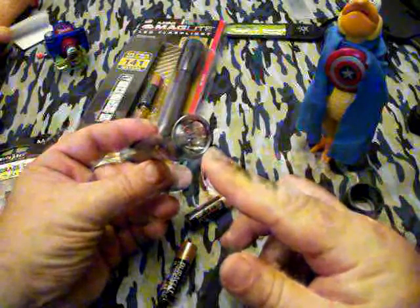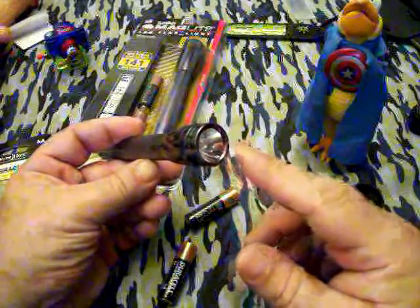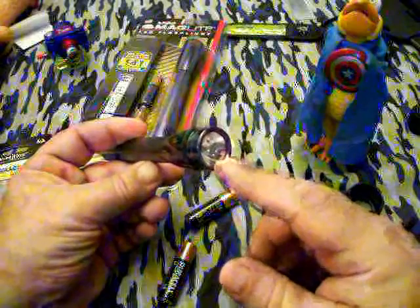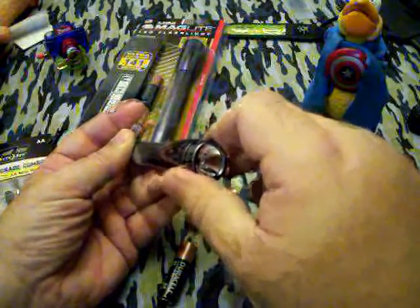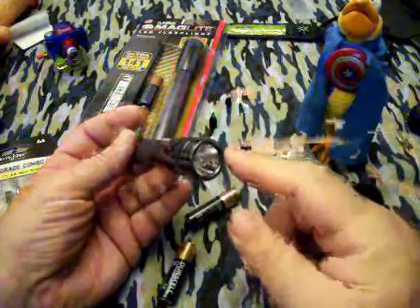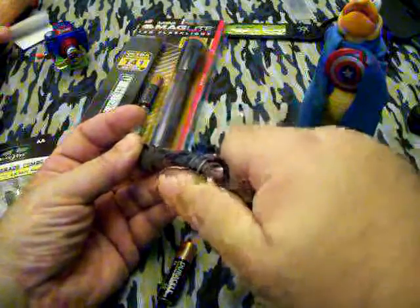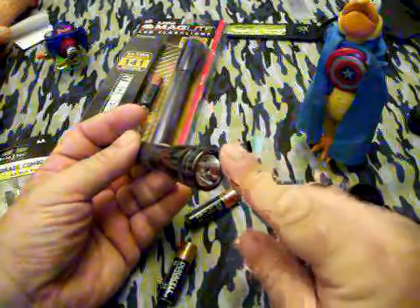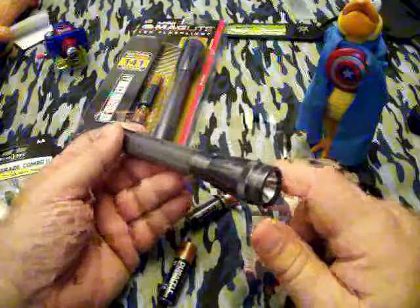Now, this is the incandescent bulb. I don't know if you can see in there, but all it is is a tiny little incandescent bulb in a reflector. That's what makes these focusable. The reflector moves, but the bulb stays stationary. As the bulb slides in and out of the focal plane of this reflector, the reflector will focus the light energy into different patterns. As you unscrew it, the reflector comes out and goes through wide to spot and back to wide again. And the way they turn it on and off, the seat that the bulb sits in is actually a pressure switch. When you wind the lens housing down all the way, it causes the base of the reflector to push against the plate that the incandescent bulb is sitting in, pushing it down, and that disconnects the circuit and turns everything off. So, very simple design and inexpensive.